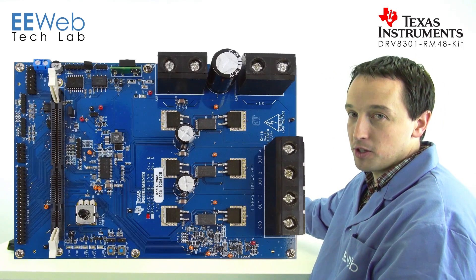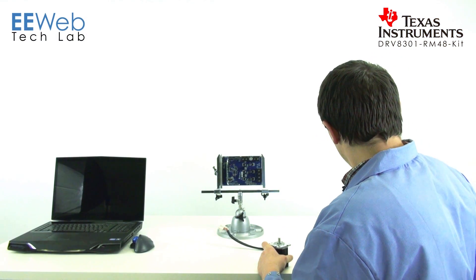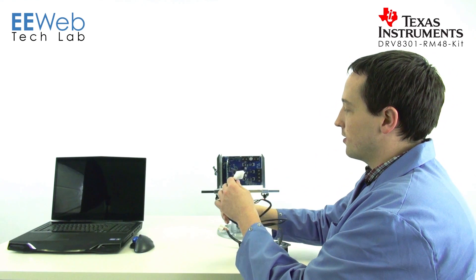I'm going to help you get set up. TI has a very specific set of directions. The first thing they want you to do is verify that jumper 2 is in place. After that, hook up the motor. First, hook up the wiring harness. The motor needs to be plugged in — looking top to bottom on the board: black, red, white, green.